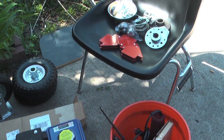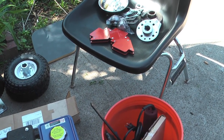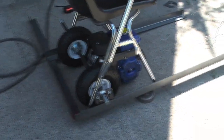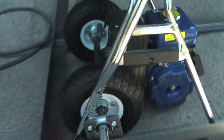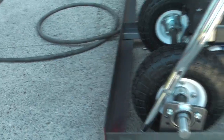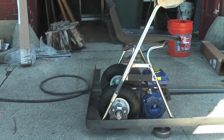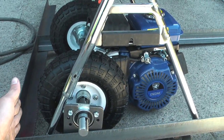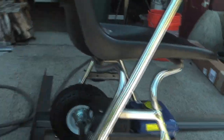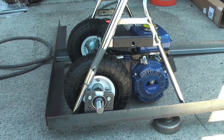First I had to figure out where to build the frame — how wide it is, the axle length, and so on. I'm gonna put the wheels right inside because I tried putting them behind the chair and they stuck out way too far. I'm trying to keep it as compact as possible. The only concern is if the drive wheels are further out there's less chance the whole chair goes flying backwards, but if that becomes a problem I'll put a wheelie bar on the back.